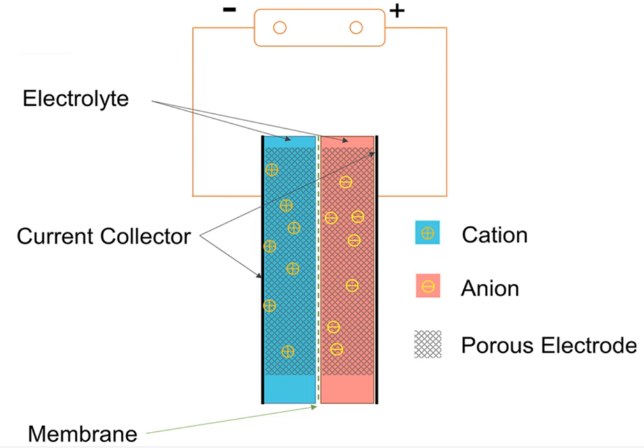Materials exhibiting redox behavior for use as electrodes in pseudocapacitors are transition metal oxides like RuO2, IrO2, or manganese-4 oxide inserted by doping in the conductive electrode material such as active carbon, as well as conducting polymers such as polyaniline or derivatives of polythiophene covering the electrode material. The amount of electric charge stored in a pseudocapacitance is linearly proportional to the applied voltage. The unit of pseudocapacitance is farad.